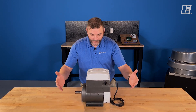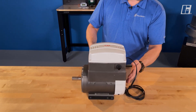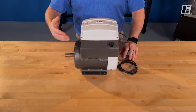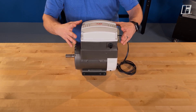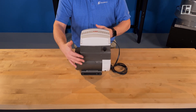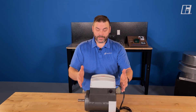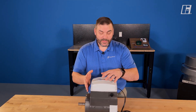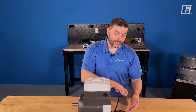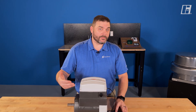Let's start off looking at our motor. What we have here is a totally enclosed fan-cooled design motor enclosure. And like all Verigreen motors — all EC motors — they have a drive in them. But bigger motor, much bigger drive, so you'll actually see the drive now. This drive is what we call a top mount because it's mounted on top of the motor. You may also find this in an axial mount where it's mounted to the backside of the motor. We pick the right configuration for the fan that you've chosen.